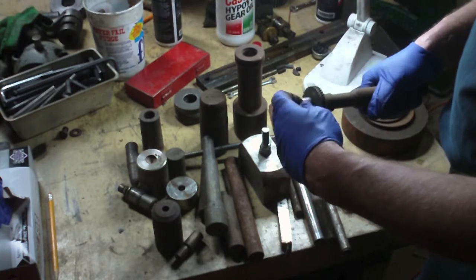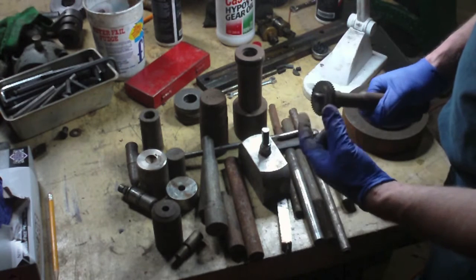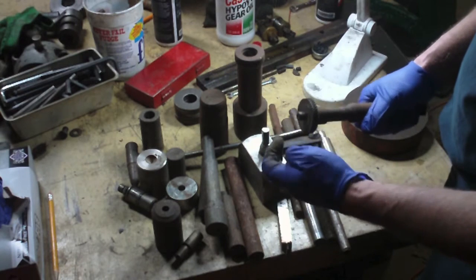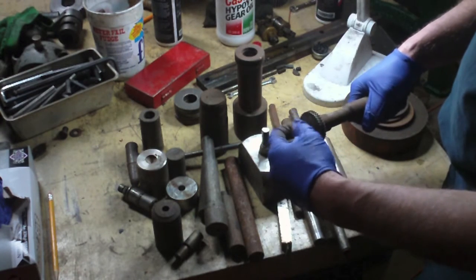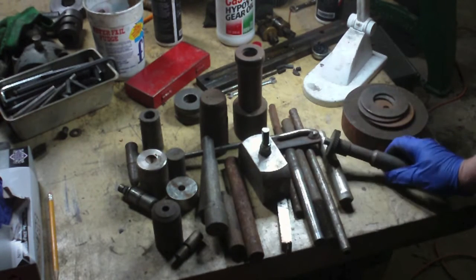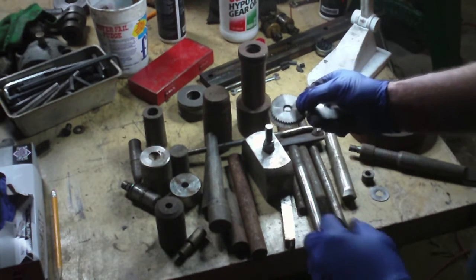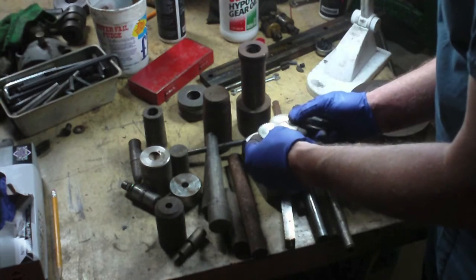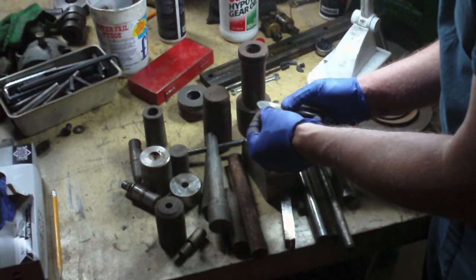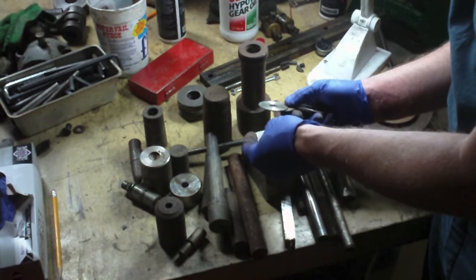and he's got a stack. This is interesting. This is reverse thread, and he's got a stack of these little cutters all together on it. Don't know what. It's reverse thread, Steve. You just said that. Now I gotta go find where that rolled off to. So initially I said these were slitting saws, but now that I take it apart, I see that there was a spacer, and then these say Thurston high-speed steel 939L .061.